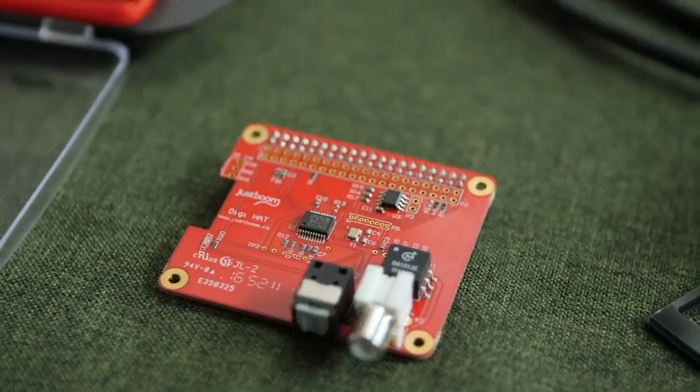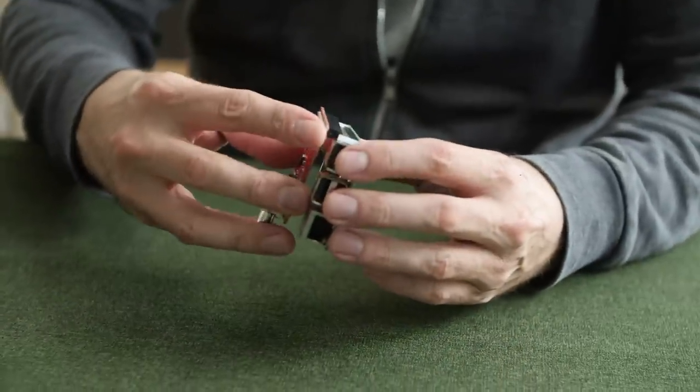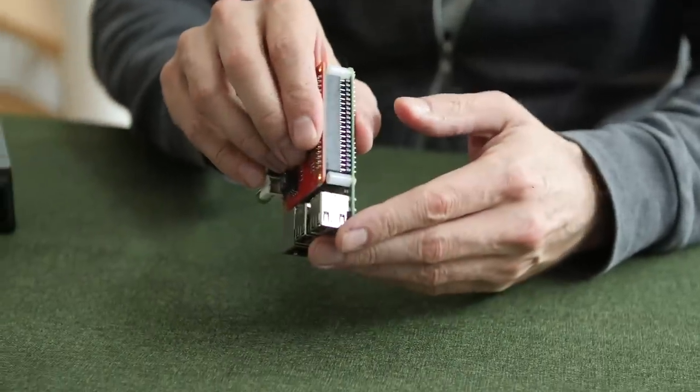So we need to ask ourselves: is there a way to make the Raspberry Pi sound as good or better than this Auralic Aries Mini? One way is with a HAT — Hardware Attached on Top. This is a board made by a third-party manufacturer that takes the digital audio from the Raspberry Pi, converts it into S/PDIF for outputs via coax or Toslink. You attach this HAT to the 40-pin riser on the Raspberry Pi, the audio is processed on the top board — it's really like a USB S/PDIF converter, though it's actually I2S to S/PDIF.